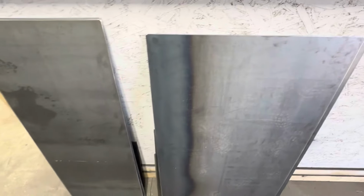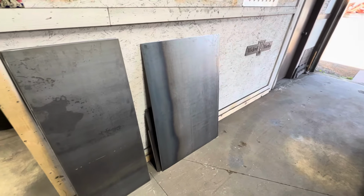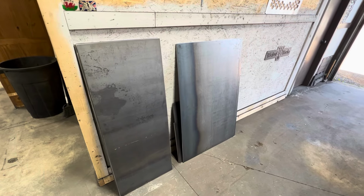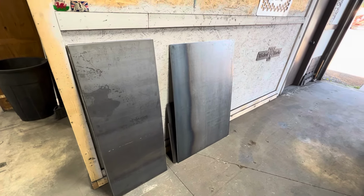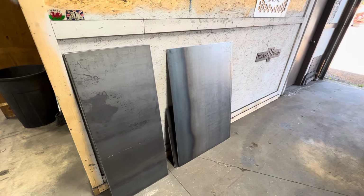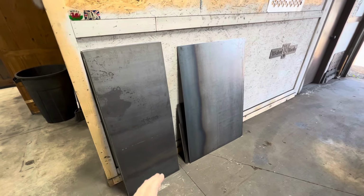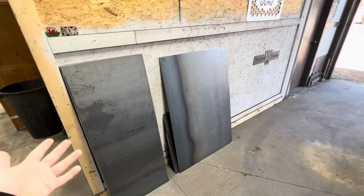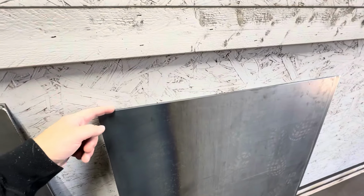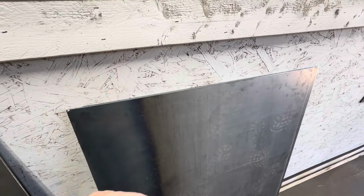I'm just making it a little bit simpler because I had to cut the other boxes, because they're just such a big, heavy sheet to bend into one uniform box. Most of these manufacturers actually do it the same exact way, where it's just pieces that are tacked together. The only difference is they do thinner and they bend tabs on the two sides so that this can sit on top and all that.